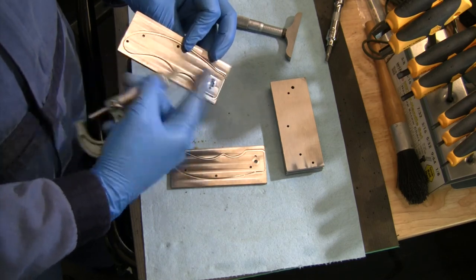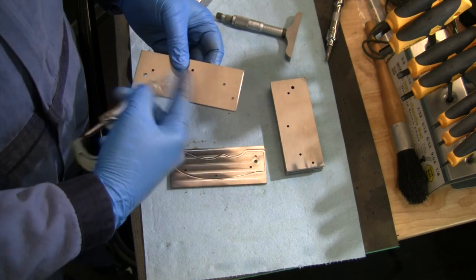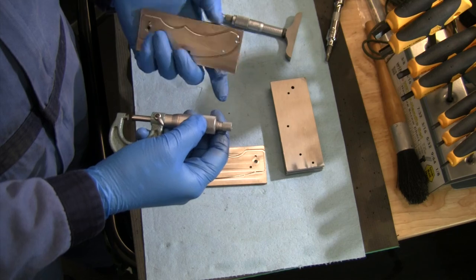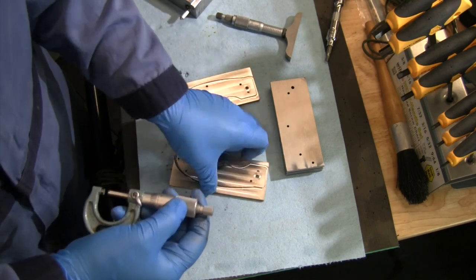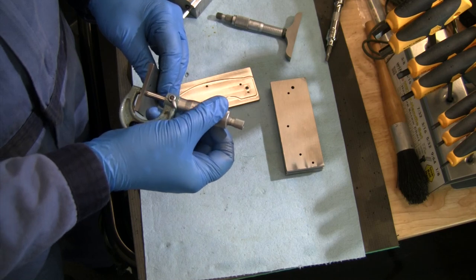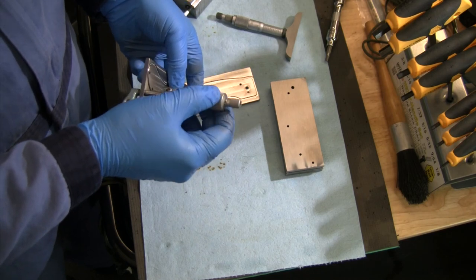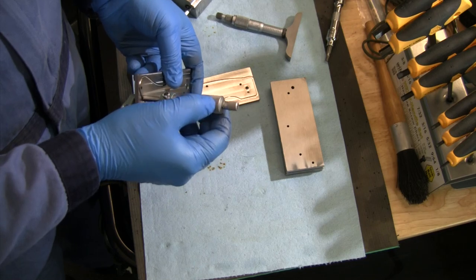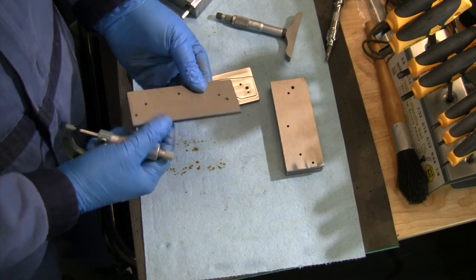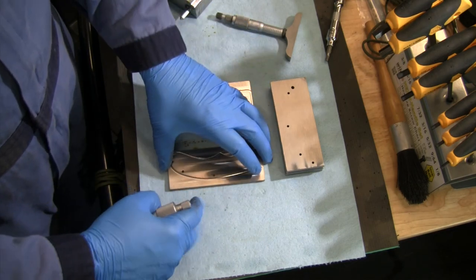The accuracy is for the inside where the blade runs. This is the contour on the outside. So I know some of them are gonna clean up on the outside, some will not. But overall, that looks pretty close. A little over 190 there. About 190 and a half, 191. So they're sitting pretty good in that pallet.